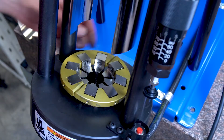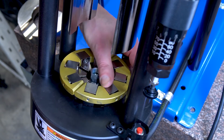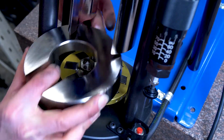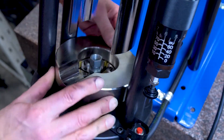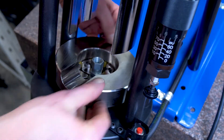Insert the hose and coupling into the die set as shown. Position the coupling to the proper depth according to Kurt guidelines. With the hose and coupling ready, place the pusher donut on top of the die set with the clearance slot faced forward to the operator.